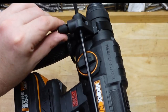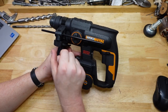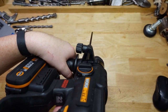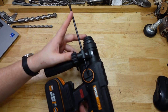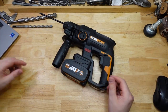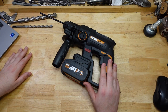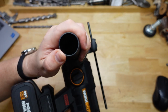One thing I noticed before testing — thankfully — was the depth rod. It actually gets pushed off kilter by the tightening nut, so when it was out in the drilling position it wasn't running straight, it was at a bit of an angle. But I was aware of that before drilling, and since I use the depth stop for timing, the geometry is important. To even out any imbalances, I just drilled one way, then the other, and the numbers ended up pretty tight — so I'm happy that didn't really bias the results.